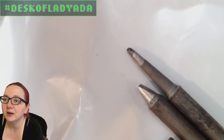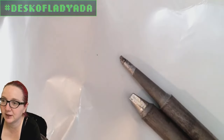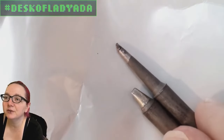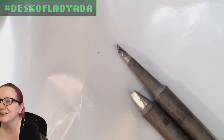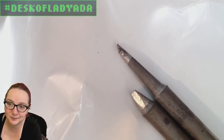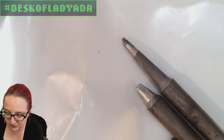So this is a hoof tip. The black spots are just oxidized flux — these are actually very clean, good quality tips. The hoof tip is good for drag soldering, for QFPs or QFNs. I'll admit, I don't do drag soldering as much — it's a stylistic thing, some people like to do it. But hoof tips will hold a little bit of solder on the tip, while still providing a small amount so you won't get as much bridging.